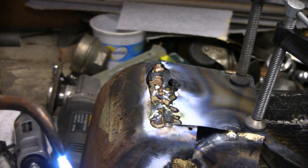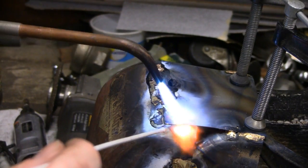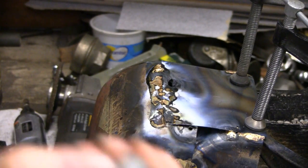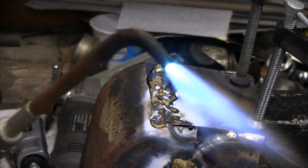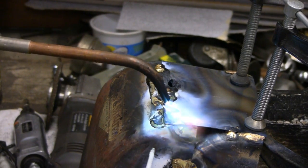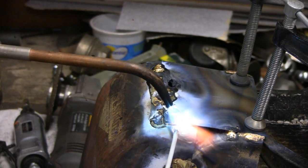Get out of here — go work on something mechanical before you hurt somebody. Thanks, buddy. I do have this flame a little too hot, let me turn it down a little bit. That wasn't Mike's fault — he stuck his finger through there. Let me fix my flame. I fixed my flame so it wasn't as hot. Got a little three streaks coming out — that's what you want. Takes a little longer, but you know you won't burn through the metal.